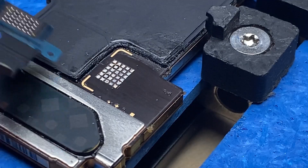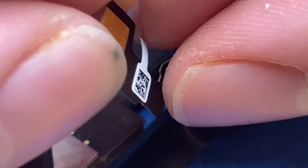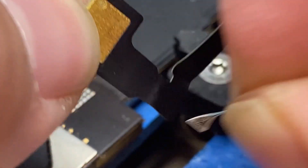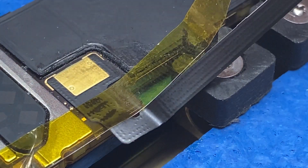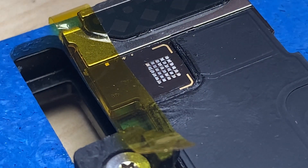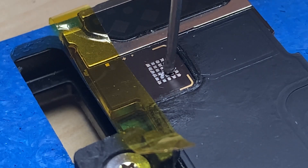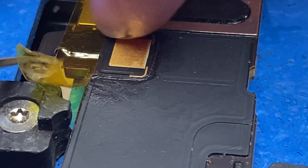Please take a moment to like and subscribe if you're finding this content useful. The new flex cable comes with some adhesive, so we'll peel that off and flatten it out — the protective film is just going to melt under heat so let's remove it. We'll line it up and push it into place, then take some kapton tape to hold it there. I also need to add a little bit of flux. Line it up again and secure it down with tape.